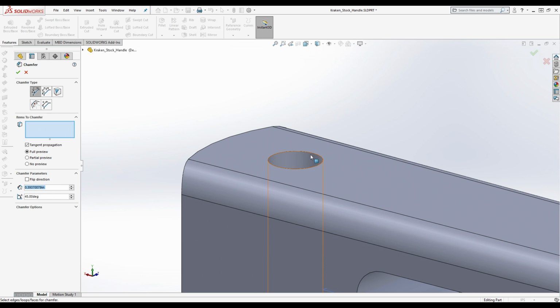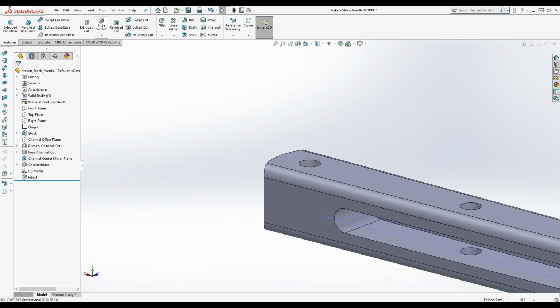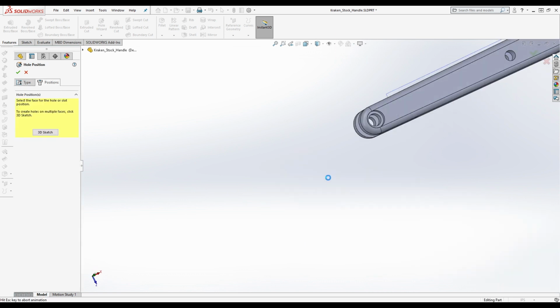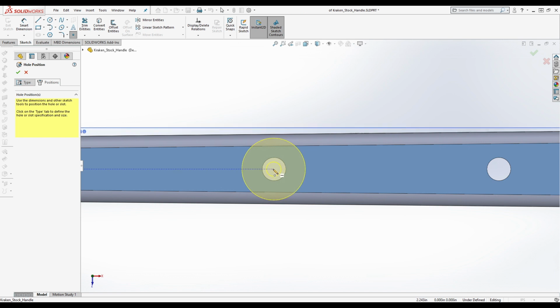So I'm trying to think of the best way to do this. I'm just eyeballing kind of. I'm trying not to scratch the countersinks. I'm eyeballing, admittedly in quite bad lighting, seeing what the width at the top of the countersink is. And it looks like it's 7/32 approximately. Let's see, what is 7/32 again? Maybe I'm misremembering this. Yeah, no, I was right. It looks like 7/32 for the main ones, and then it's a 1/4 inch at this bottom one. So we're actually going to do that. Even though I know that's a little bit of extra work, we're going to do it that way anyway. So we're going to do the two that are the same size here. Why is this?